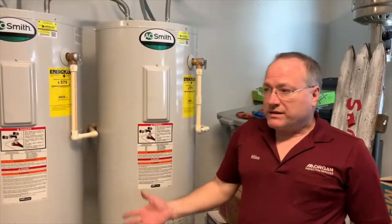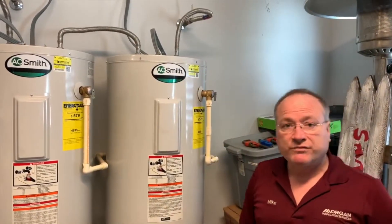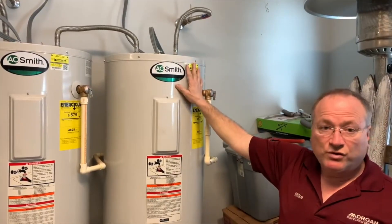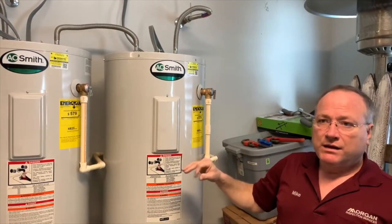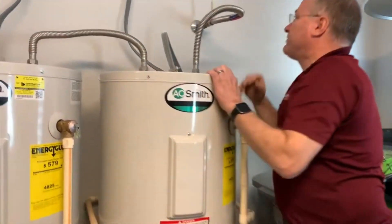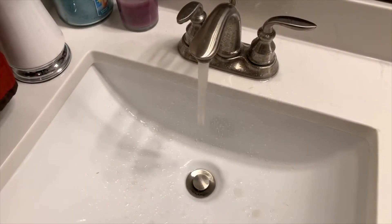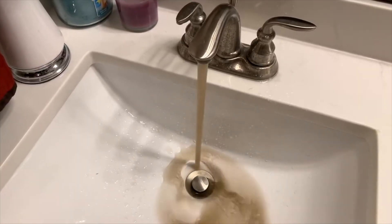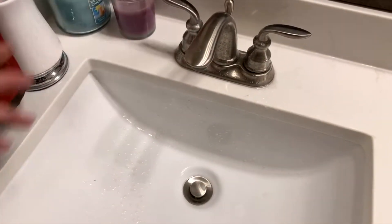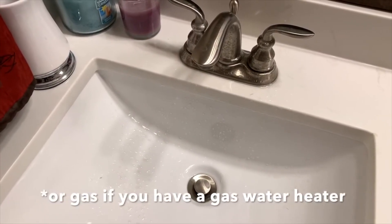We ought to be back in business. The last thing we've got to do is open up the water valve to fill the water heater, then turn on the breaker and we're done. You want to make sure you turn the water on first and make sure the water heater is completely full before you turn the breaker on — you don't want to risk turning on a heating element that's not covered with water, because it'll quickly be ruined. Once we can confirm the water heater is full, we can go turn the breaker on and we'll be done with this project.